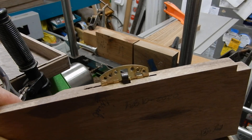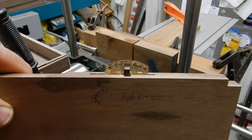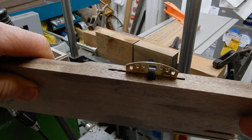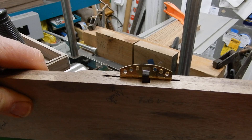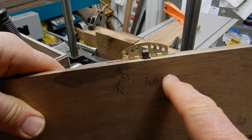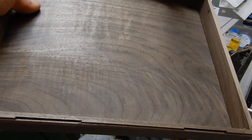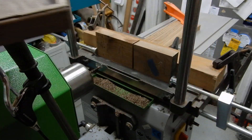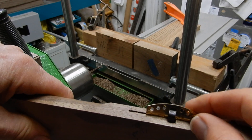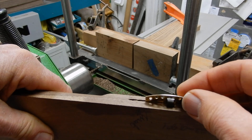This video shows the kerf hinge used on some of the boxes made here at Rolf Woodwork. This piece of wood has a very thin slot where one side of the hinge is inserted. The barrel of the hinge is on the outside position, with this being the inside of the box. A lid would have two slots, as you see here, to clear the spring-steel load on the hinge that holds the lid open at almost a right angle.